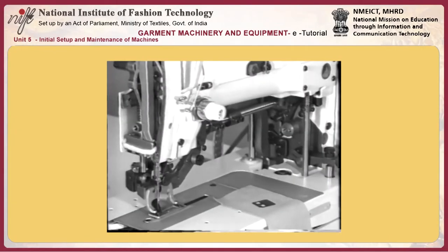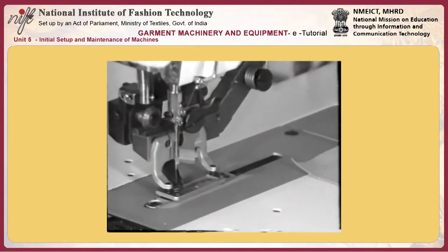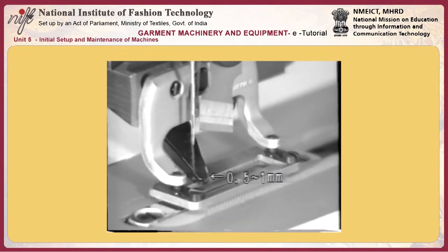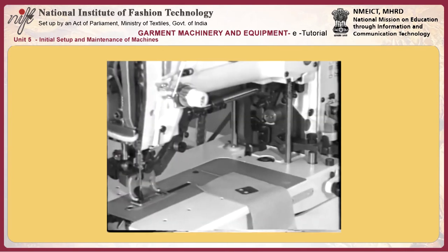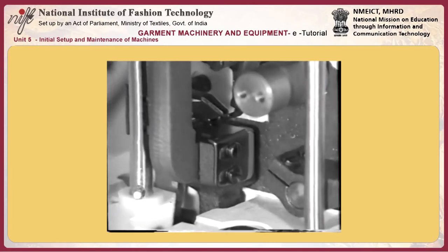Be sure that pin R of the needle thread trimmer does not come in contact with the bottom face of needle thread trimmer driving plate A, and that pin R does not touch knife driving plate B. Check to be sure that the blade of the needle thread trimmer cuts the thread at portions T and Y and does not cut it at portion Z.